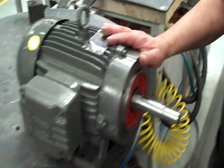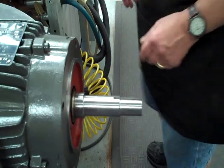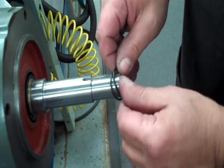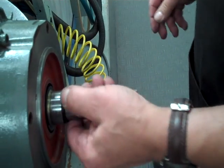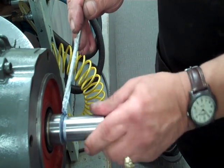What we have is a JM motor. I've already cleaned the shaft and prepped the keyway. Next thing I want to do is add a few things to the shaft to make the build easier. We've got two O-rings that are going to go on behind the sleeve that I put the seal on. Put a little lube on that so the sleeve fits over. Fairly easy.